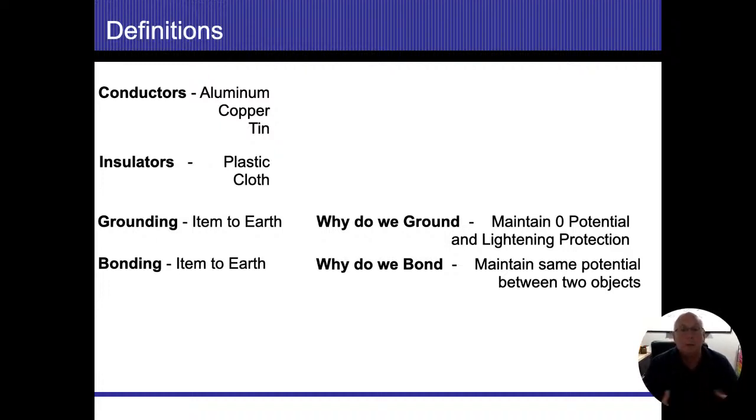And when we talk about voltage and electrical flow in a little bit, we're going to be discussing how I have to have a different voltage for electricity to move. If they're both the same, then electricity is not going to move, plain and simple. So as it fluctuates, and another analogy, I guess I should back up, I like to use sea level, because we can actually see that with our eyes. Sea level is always going to be known as zero, but anybody who's ever been to the ocean knows that every day, twice a day, the sea level goes up and the sea level goes down. It changes, it fluctuates. But no matter where it is, we're always going to call sea level zero. The same thing with our electricity, our static electricity, our voltage in the earth, we're going to call that zero, no matter if it's gone up or down.